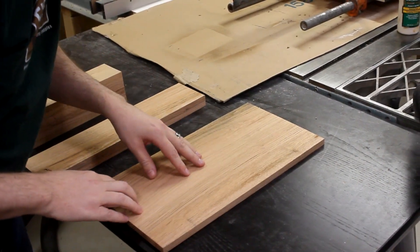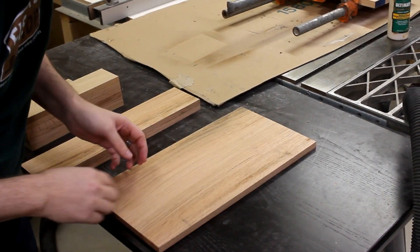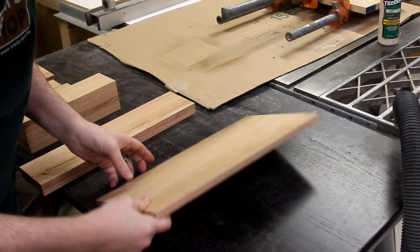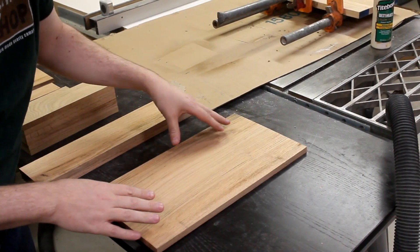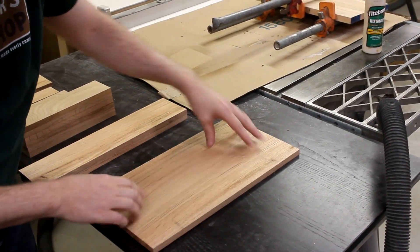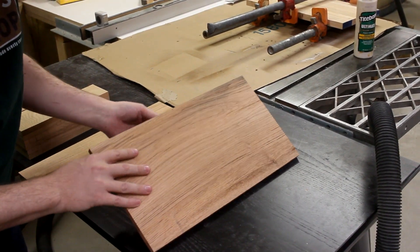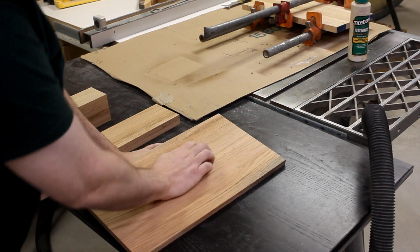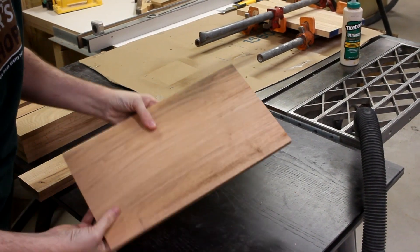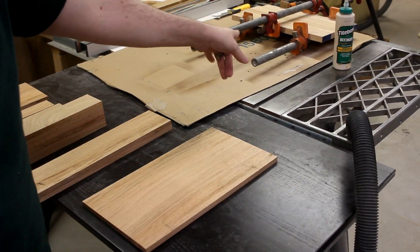After a close inspection, there is a series of cracks that run all the way up and down on this panel. This side looks good, but there must have been some kind of pressure on the inside because once it got this thin, it developed a twist and a cup. I mean, if I just add some pressure on this, you'll probably hear it crack. Oh yeah — this is no good. So that's why I went ahead and glued up another panel.